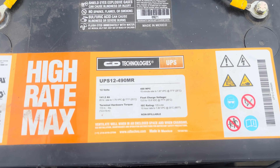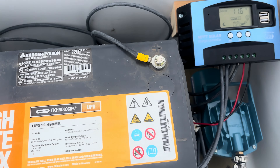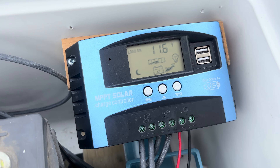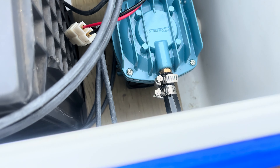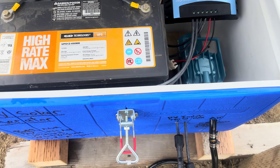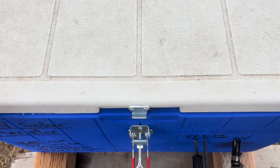Pump aerators — whether it's a windmill with moving parts and potential problems, or an AC pump aerator, or bigger DC pump aerators — this setup is going to suit my needs. The 90-liter-per-minute pump I was looking at was advertised for a quarter-acre pond, which is a little smaller than mine, but mine's not that deep and I'm just aerating the one side — the deepest part at 12 feet.